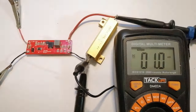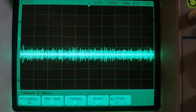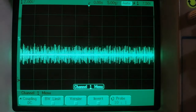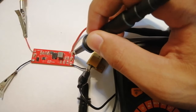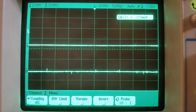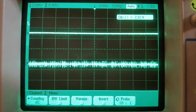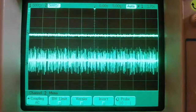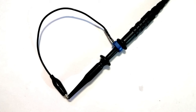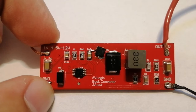Now it's time to test the circuit. The output is a pretty steady five volts. At first glance the output noise seems very high, but this is because of bad probing — not a cheap excuse. If we probe with a very short ground lead, the result is a lot better. With two oscilloscope channels showing the same output but probed differently, the noise is very different. The large ground loop from the long lead picks up interference from the switching, either capacitively or magnetically.